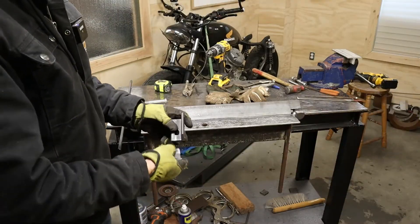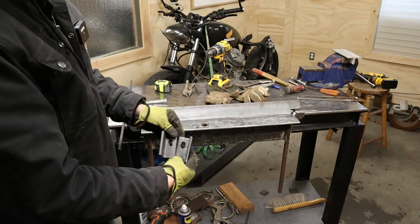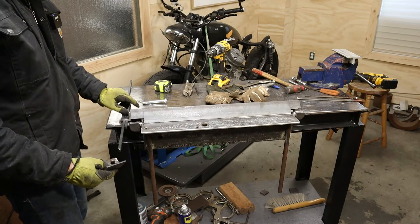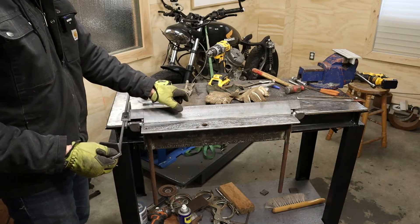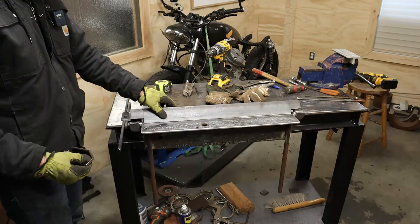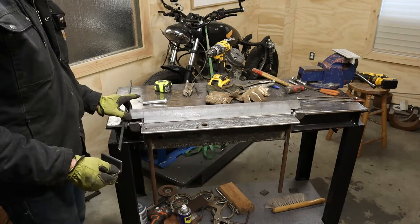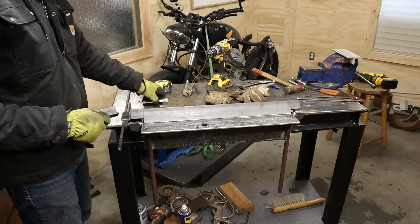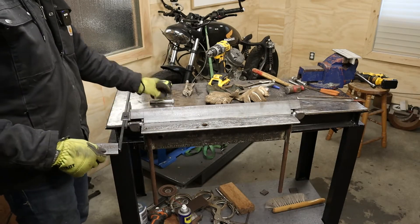So here's the two pieces that I've been working on in the shop on the dark side. I drilled a couple of holes and elongated them just so I can get some travel, so when I weld this onto the end of my bar I can get this to travel for some setback — so when I bend I can get a different radius on the bends. I don't need much; most of this stuff is fairly light, so that's plenty, more than I need to make it work. I'll show you a couple more pictures when I get this set up for my hold down.